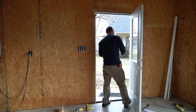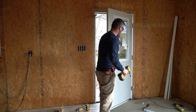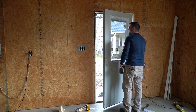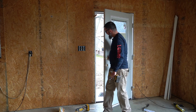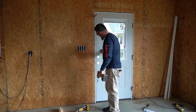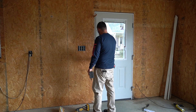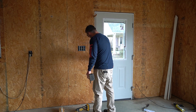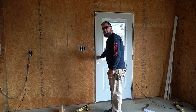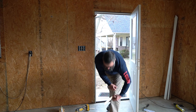I'm happy with my four corners. I'm going to do one final check for twist, and do the sides. Usually by the time you get to the sides it's real easy — you just want to stick something in the hole that's already there. You've pretty much got your door where you want it, so the goal for the sides is not to screw it up. If you wedge something in there real tight, you could have to redo the whole thing. I'm listening for the weather seal brushing down there — I can hear it making contact, so I'm happy with that weather seal.